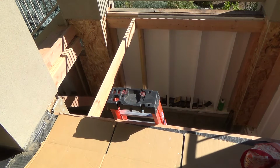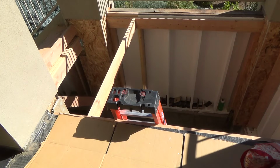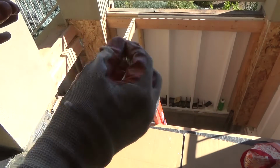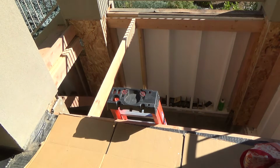And if I've got a huge room, then once I get the strings up, after I put the wall angle up at the ceiling, I can measure along the string, just the string, after I have it pulled really super tight. It's called jet line. It's a string for T-bar ceilings. You can pull it really super tight. It's really thin, and it's hard to break that stuff.